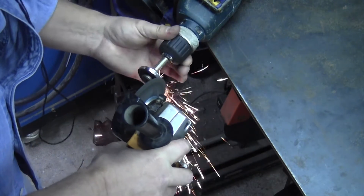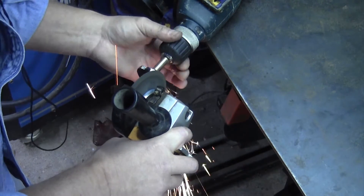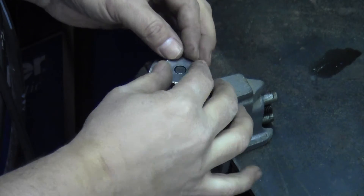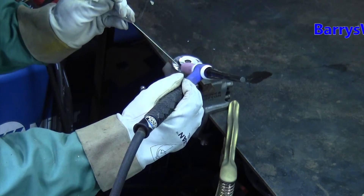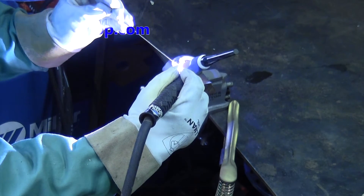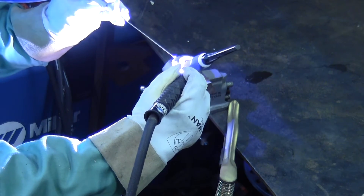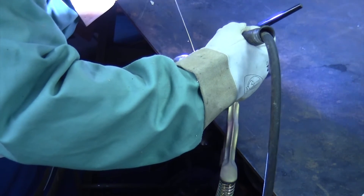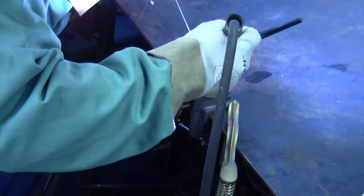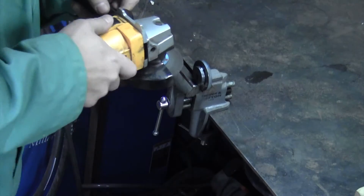And I repeat the same process for the smaller piece. So now I'm going to join this smaller inner piece with the larger outer piece. I use the drill bit that I drilled the hole with to center the pieces, and then I'm just going to go ahead and weld them together — this is just a spot weld to hold them together, I don't want to add too much material. I'm adding just enough filler so that when I grind it down, it'll still make contact between the pieces. Then I'll go ahead and grind off those tack welds so that the inner piece is totally round.